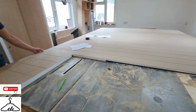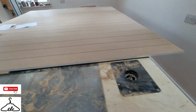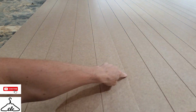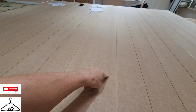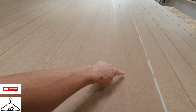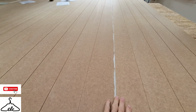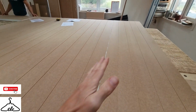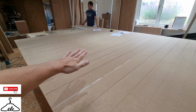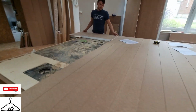So now we've done all the doors, all the longer doors. There's 4 here in total. We've got the 3 bigger doors. That's one joint. That's another joint. Well, can't even see the other joint. There's the other joint. And yeah, there's another joint. So basically we've lined them up now so they're all completely flush, top and bottom. So they're all as they should be, or as they will be on site.